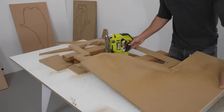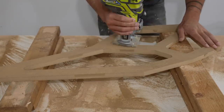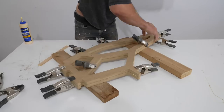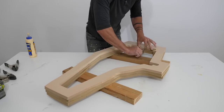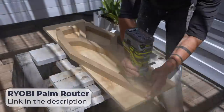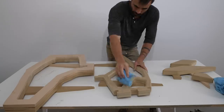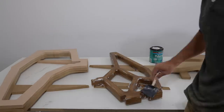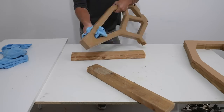For the silicone molds I'm going to need an outer rim, so I used my jigsaw to cut the tabs to remove the leg pieces and also cut the perimeter around them. Both the silicone and the epoxy are expensive materials, so most of the thought is going into making sturdy reusable molds that are materially efficient. The legs are going to be about an inch and a half by an inch and a half, comprised of two layers of three-quarter inch MDF. I rounded over the edges with my palm router because epoxy corners can be quite sharp. The smoother I get the MDF the less sanding I'll have to do, so I typically sand to about 220 grit then apply a clear coat — in this case Minwax polyacrylic — doing a light sanding with 320 or 400 grit between coats, and typically getting it smooth enough in two to three coats.